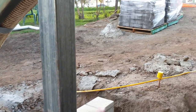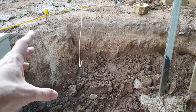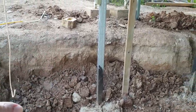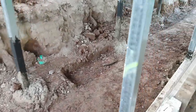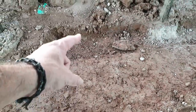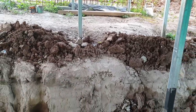Along the front here, they just arrived the other day — we've got a link block retaining wall going in that will meet up with this retaining wall. It really just needs to hold the earth back, nothing too structural. A lot of the water as it runs off will be diverted elsewhere so there'll be virtually no erosion there. The link block wall starts just in front of that line there, going up on a slight slope, and above there we're going to end up putting a concrete pad and water tanks in the future.